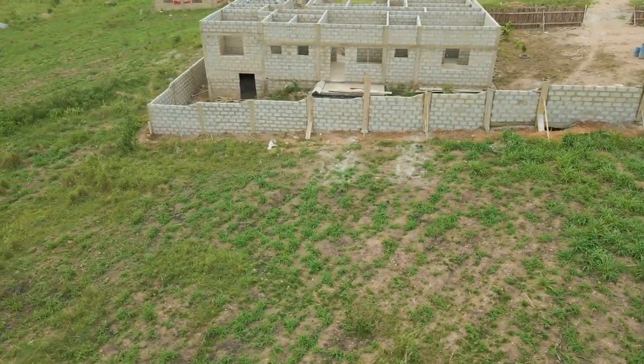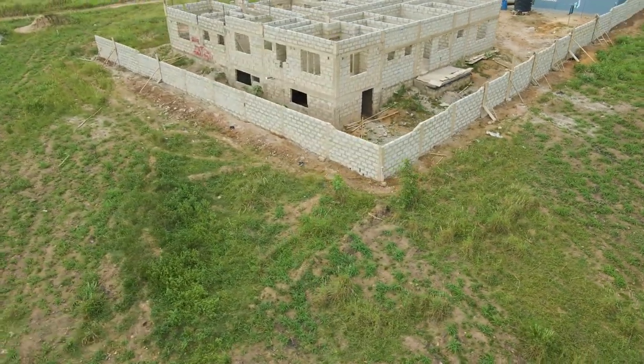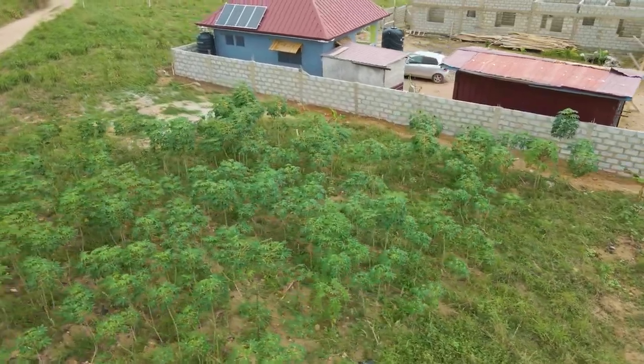If you want to know the quantity of blocks per side, you just divide accordingly. For my two sides, that would be about 1,025 pieces of blocks. If you want to fence all four sides you're looking at around 2,050 pieces total. The extra blocks were due to the steps introduced and the number of courses. For cement, since we used 51 bags total, that's about 25 to 26 bags for two sides.